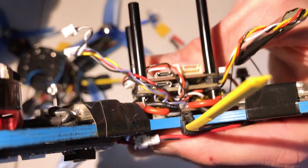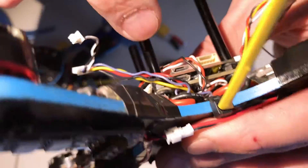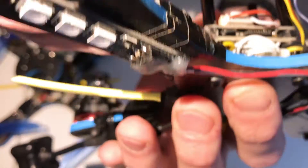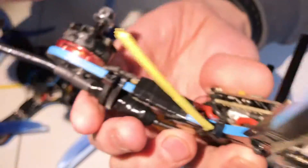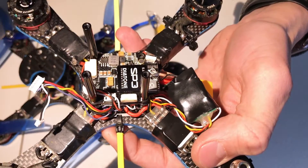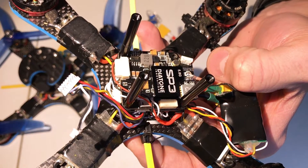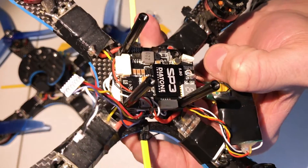I don't know about you guys, but to me that sounds like a problem — it would create some problems. After I tightened my stack down, it was kind of squished in between there. My solution was to rotate it. Another one of those little black chips was also touching my USB in a couple different directions. I ended up putting it in a new orientation where none of the things on the bottom were touching anything from my flight controller. I think that could have been a big contributing factor to my bad video.